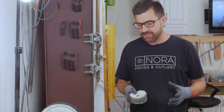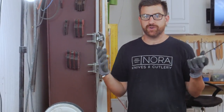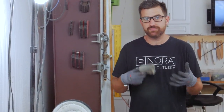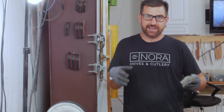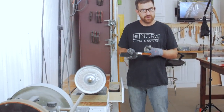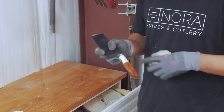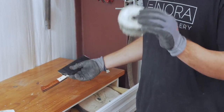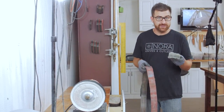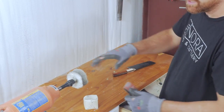The biggest thing on polishing handles and polishing wood is that some materials are porous and some are very dense. Porous materials will look dirty; dense materials will look like glass as soon as you polish them. Porous materials will start looking like glass with dirt inside. So the big thing is getting the right amount of oil to fill all the voids and gaps so that when you polish it, it looks very shiny and doesn't look dirty. I clean the buffing wheels all the time using just a belt, or if I really need to clean them I soak them in acetone.